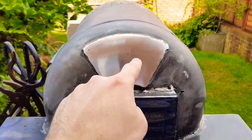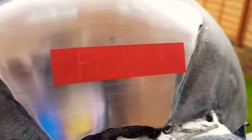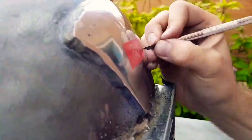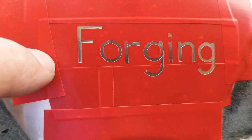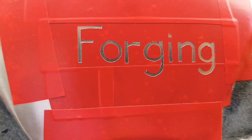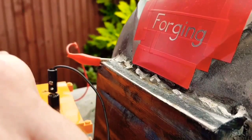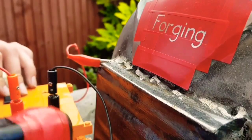Next is to try and mark out my logo on here somehow. And so begins the really slow process of trying to cut out my template — I'm not quite sure how this is going to go. If you didn't see my video on electrochemical etching, I made my own machine. Basically what you do is send a current through salty water and then through a pad — in this case felt — and it eats into the metal and creates an etch. Hopefully, like you will be about to see.